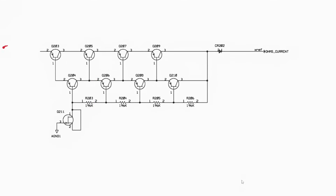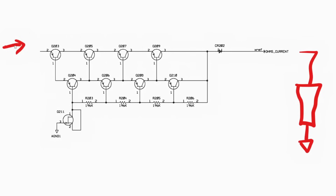Now for the output section. The current source is over here, and it creates a current that flows to the device under test. Dropping voltage along the current path doesn't matter - if we set up 1 milliamp, that 1 milliamp flows through all of this. So what is all this output circuitry? It has nothing to do with generating the current - that's already done. This is a protection circuit to guard against accidentally applying a high voltage, like 1000 volts, to the meter input.